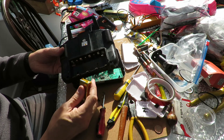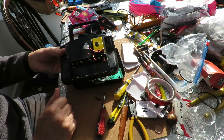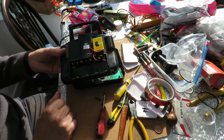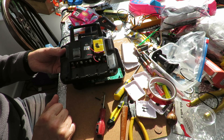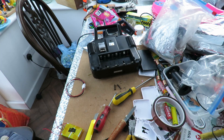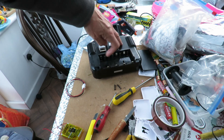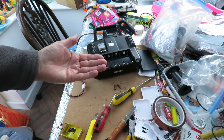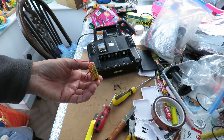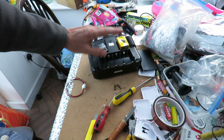Or we go the easy way and just stick the battery on the outside — then I don't need to cut anything. And you can have the LiPo alarm sitting on the outside as well, then it's all visible and easy to work with. I've had a few thoughts. I think the sensible option is just to solder on the connector for a LiPo battery to the positive and negative, try it out with a 3S battery and check that it works. And whether I decide to fit it inside or externally is something I can look at later.